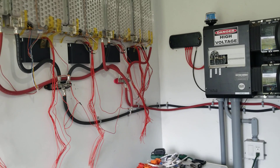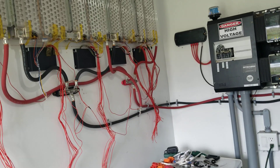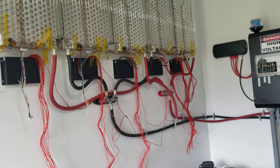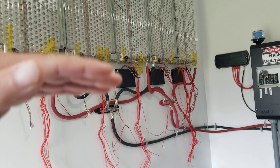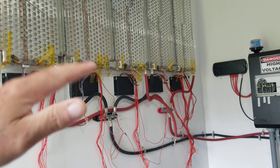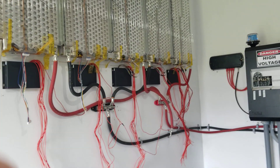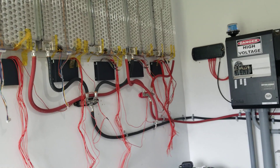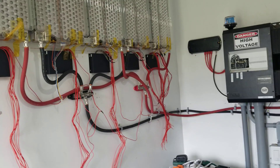I've been looking for a long time online, trying to figure out a way to put something in line that will basically disconnect the battery. These active balancers here - as you're charging or discharging, if one of the series cells is higher than the other, it'll take that energy and put it towards the lower cell to bring it up. It tries to maintain an equal playing field all the way across the board, and they work very very well. But it's not a BMS - it's an active balancer.